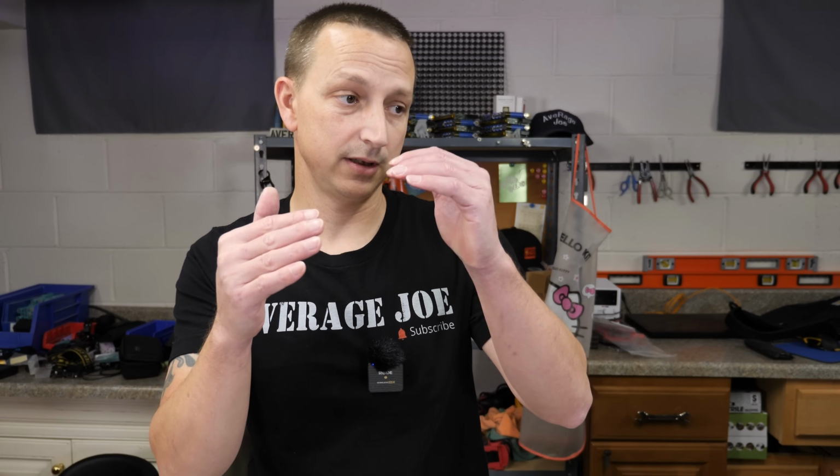Again, another little sidebar is they say you need to do a couple of capacity tests to basically calibrate the BMS. Now, I do a lot of DIY stuff with batteries and BMSs. I do fully understand cycling it a few times to calibrate the BMS. I feel like that should have been done already. And I think that's pretty much all I can come up with at the moment.